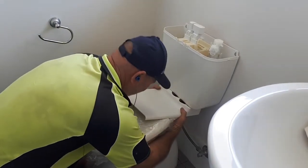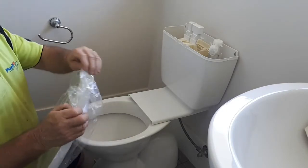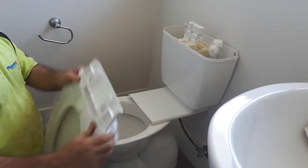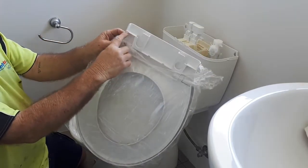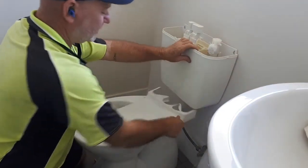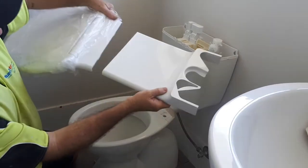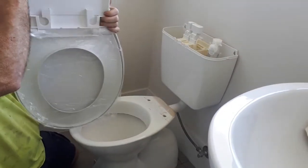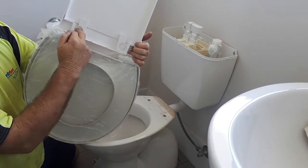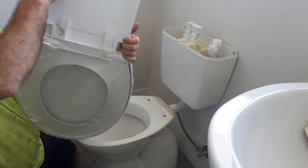Slide it up as far as it goes in, and on your seat there's this part here — about there. Now that's how far this slides in. So this slides up underneath there like we just had it, and then your seat slides onto here, it slides into there. That part here is where this sits down into — that's your play area. So you can have these bolted up and you've got about 25mm of play movement when it slides up.